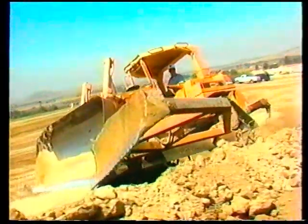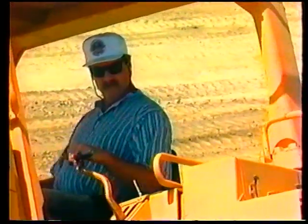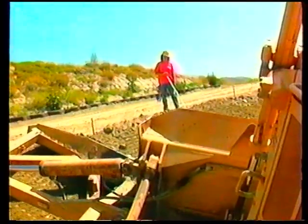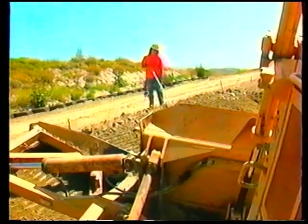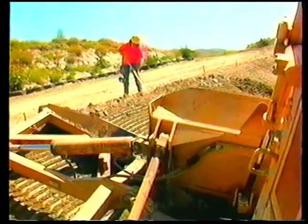After roughing in the slope, move back to the far left side of the slope. Lower the slope board level with the dozer blade. Locate the dozer down the slope far enough so at least 1 foot of the slope board is above the top of the slope. Begin to trim the slope. Remember, first or second gear and low throttle.